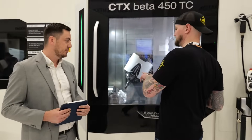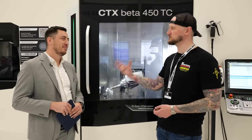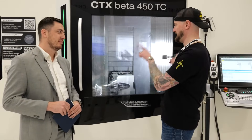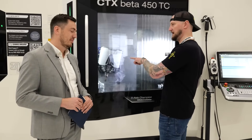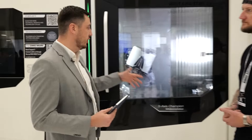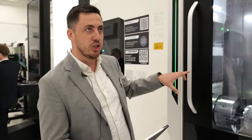These are actually equal spindles — in a lot of machines there's a main spindle and a sub spindle, and usually the sub spindle doesn't have the same torque or the same RPM. You're saying I could run the exact same part on both sides with the same RPM and everything? We have two different options: a smaller spindle in standard, and then we go up to a four-inch more capacity as the bigger spindle, which we can match on the counter spindle side. That's why I call it counter spindle, not sub spindle — we have really equal possibilities on both sides.